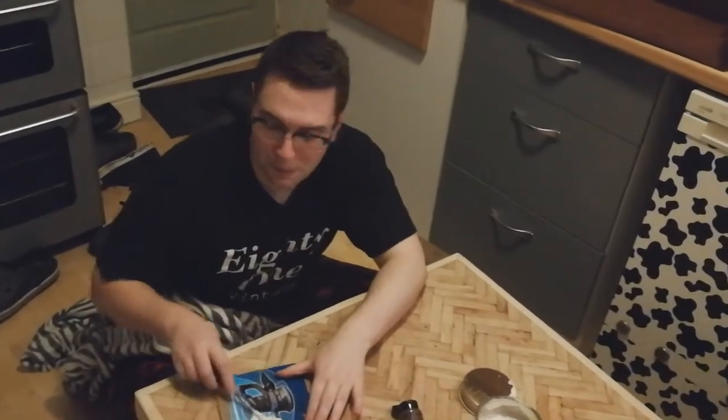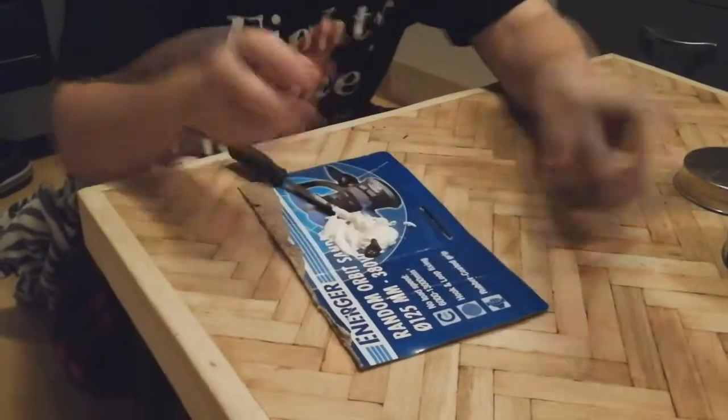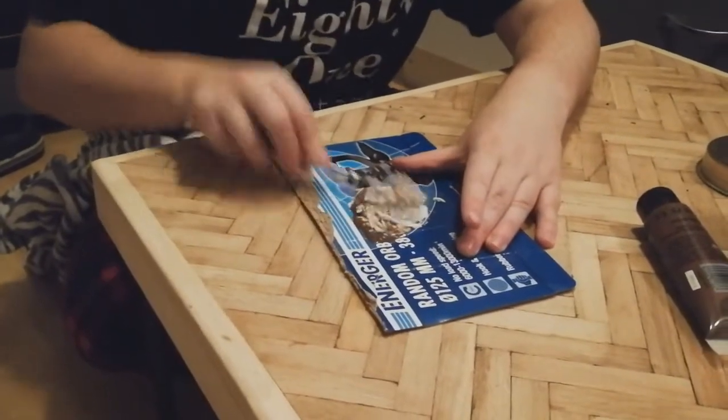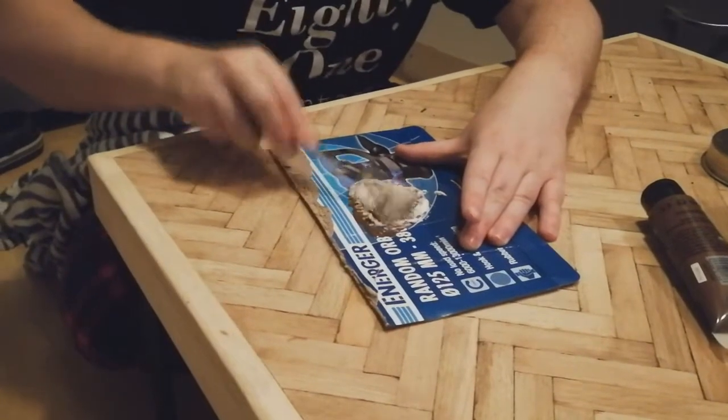I've showered off after all that sanding and now I'm just going to do some filler around the edge. This filler comes white but my piece is oak, so what I do instead is add in a small amount of acrylic paint to the filler and mix it with a spatula or screwdriver. That gives you a really good wood colour match and I use this a lot — it's just going to go in the gaps and I'll rub it all the way along.